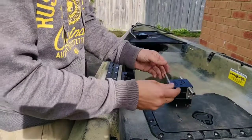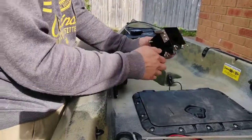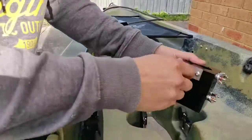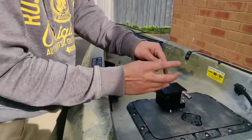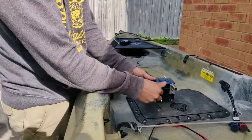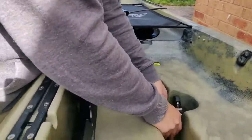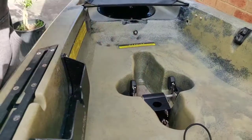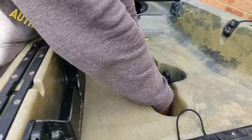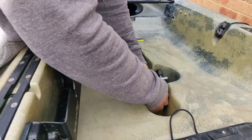And then after you take half a mil, stick it back in here, keeping it loose, sliding, and retry it. If you're finding that it's better, but it's still tight, take it out, keep taking half a mil off until you get to the perfect scenario where you go to test and you get results like this. You push it in and it clips in crisp, nice and sound. So you take it out, of course, at this time carefully, not to disturb the lower pin, like so.